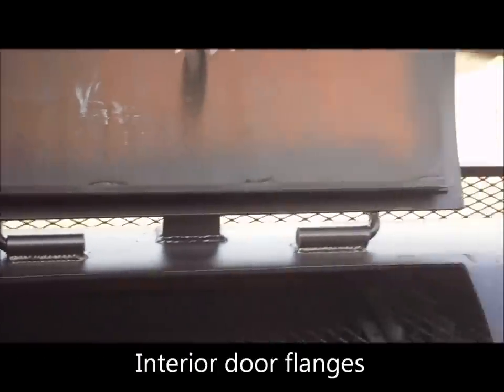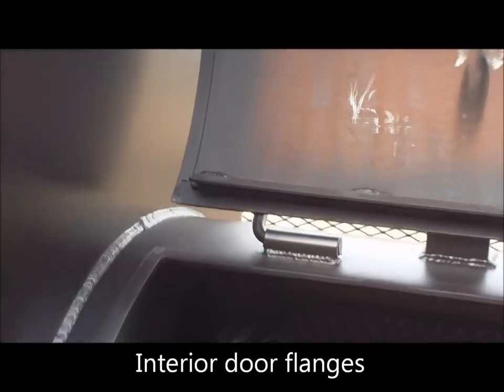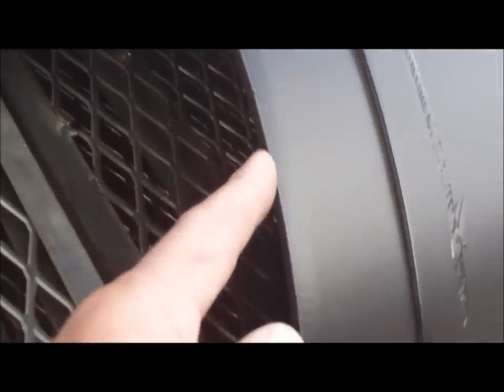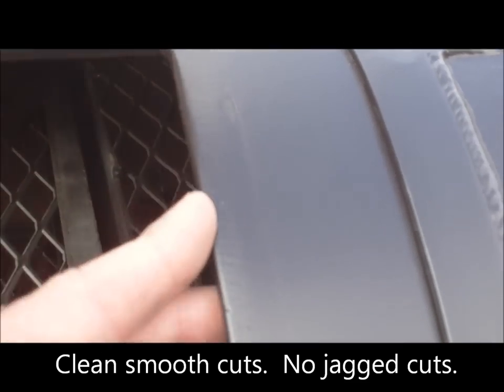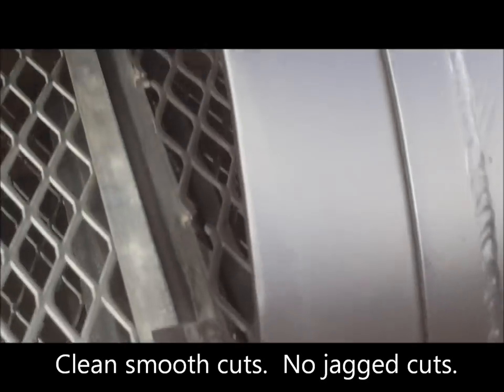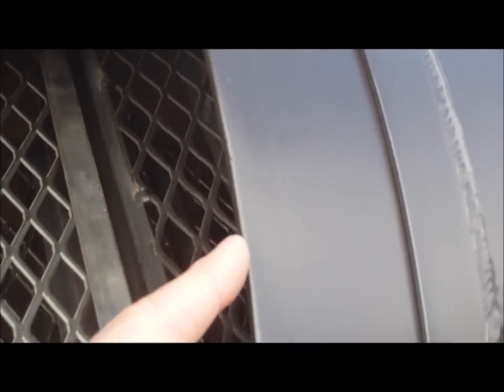Let's get inside this pit. We even put flanging on the inside of the door, top and bottom, giving a nice tight seal on the inside — helps minimize any smoke or heat loss. We do everything we can to make these doors as tight as possible. Nice clean cuts on the inside — no jagged cuts, everything's nice and smooth. This is all done by hand; we don't use any rollers to roll our steel. This is pipe — brand new pipe. We cut the doors with an acetylene torch, done by hand.